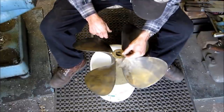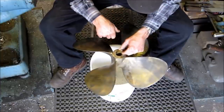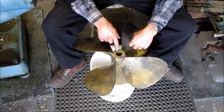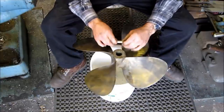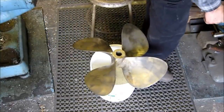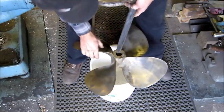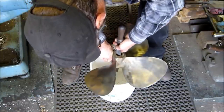We can just go past that — we're all free right in there. Even though that might be in the draw area, we want to make sure that our key is 100% free through this area right here. So the first thing I'm going to do is get in here and file the clearance. We want this key to slide freely in the propeller — you tap a key in the shaft, it should slide freely in the propeller. We're not trying to open it up excessively, all we want is a good sliding fit.